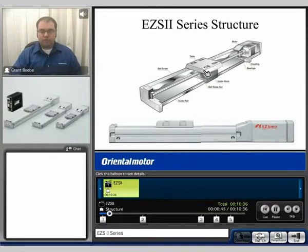As the ball screw goes through the ball nut and the screw turns, it's going to generate a linear motion all along the length of this guide. You can actually attach the load onto this platform, which is on the guide in the form of this output table shown here.